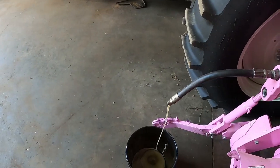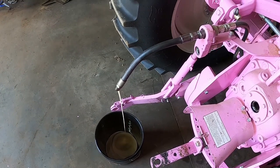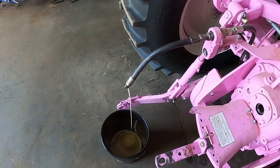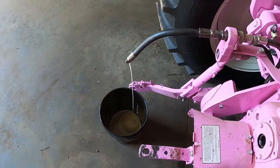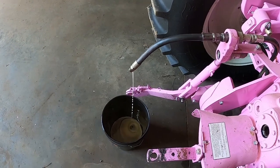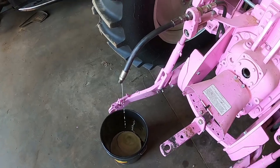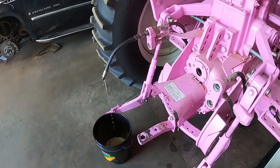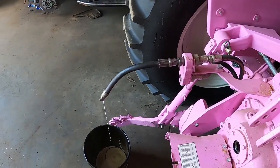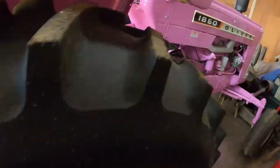There's that residual pressure I was talking about that the Olivers have. The fact it wasn't pumping that out on idle means the pump's probably a little on the weak side anyway, so it's getting a new one. I can see it's pumping air. If you were tearing this apart for something besides the pump I'd shut her down right away, but this one's getting a pump anyway so I don't think I'm going to do a lot more damage.